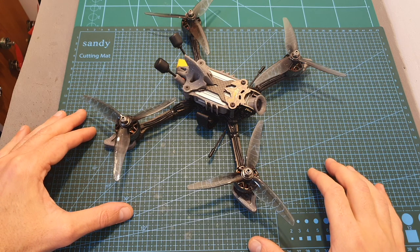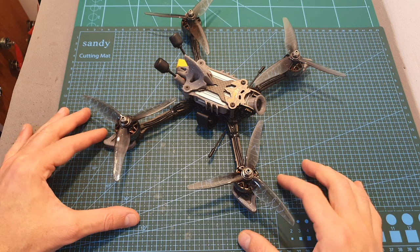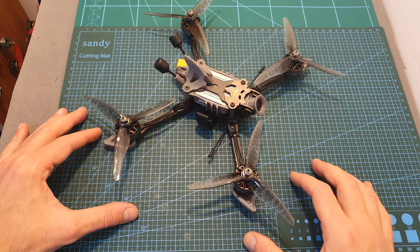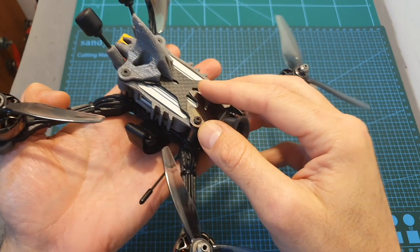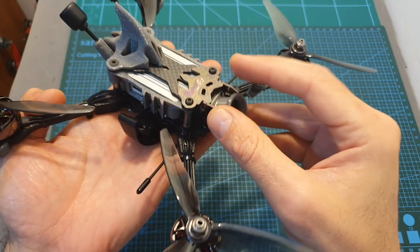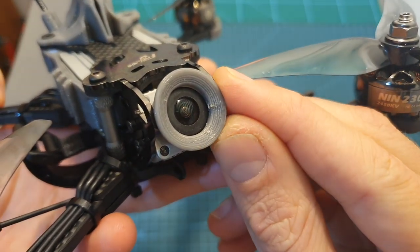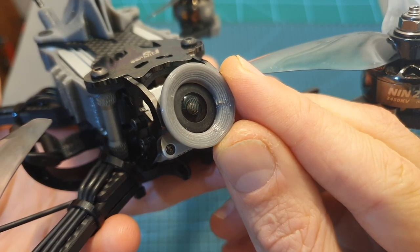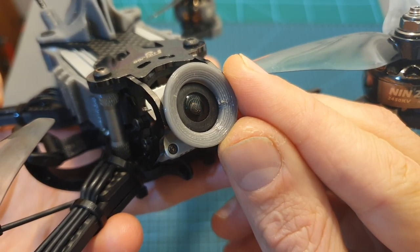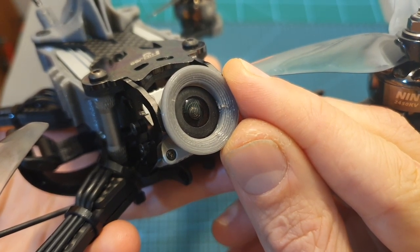After testing it out, I can tell you that I'm really impressed with the performance of this quadcopter, and the combination of motors and frame works really great. In addition, the 3D printed TPU parts, which are also bundled with the frame in case you get it on its own, will provide you with plenty of protection, and I think that this kind of accessory is a must, especially if you mount the DJI air unit on a racing frame, but keep in mind that if the camera is set to a 4:3 aspect ratio, it's going to appear in the corners of your FPV feed.